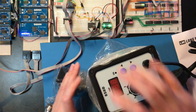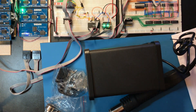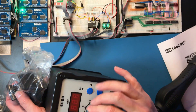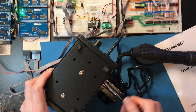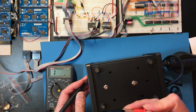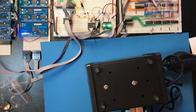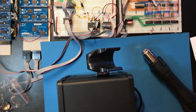So I showed you my first ever attempt at SMD soldering. I'm going to see if I can assemble this, get it going and make a first attempt at reflow. There's airflow and a digital display for temperature. I don't want to take this apart at the moment. Whenever I'm dealing with a piece of cheap Chinese hardware I just grab the multimeter and check that the case is earthed — and if the case is earthed there's very little that can go disastrously wrong, because if there's a short of the live mains to the case it's just going to blow my circuit breaker.